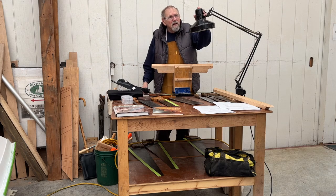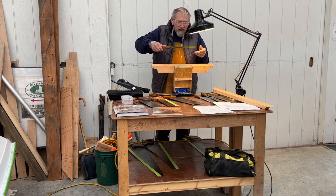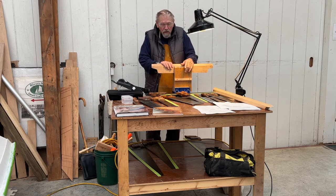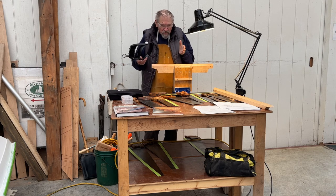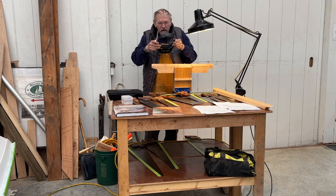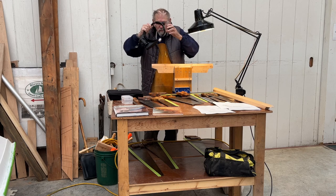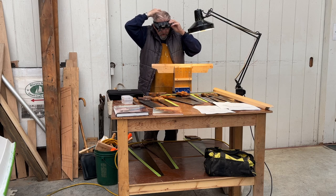You're going to need good light. This lamp works pretty well. Payson says to use natural light — have your saw bench set up by a window — and that's a good idea. When you cut your gullets, they will reflect back so you can tell where you've already cut. This light is really nice for small blades; you can clearly see where the gullets are.